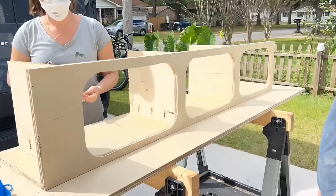By 7 PM we finally got one door on to test-fit it before fiberglassing — the window opens and closes really nicely and has a lock. We took them off and fiberglassed them: rolled a layer of TotalBoat epoxy onto the bare plywood, laid the cloth sheets on top, let them soak in, added more resin, and let everything sit overnight.